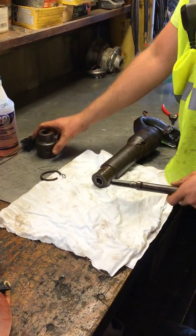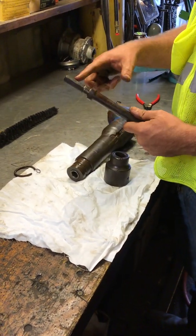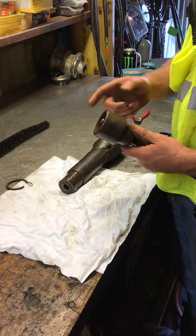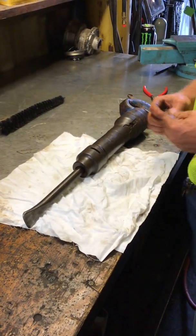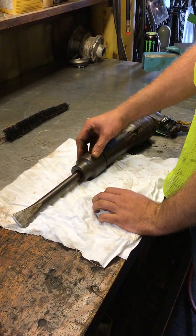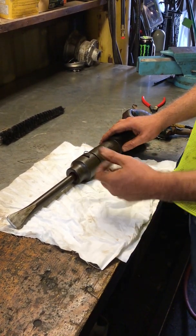You're ready to put this back together. This particular gun can use either the round shank oval keeper or the hex shank oval keeper as well. If you have a gun that's made for the hex shank, it will not fit the round shank — got to know your bits. Put your spring back in. If you're using this in the water, always put tape on here because if you can't see your hands, your spring can fall out and you'll lose your bit and your collar — neither of those things are cheap.